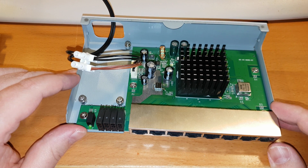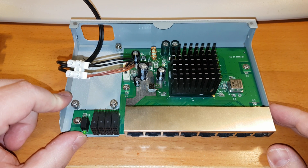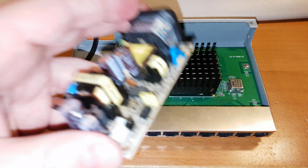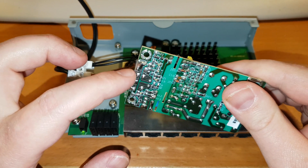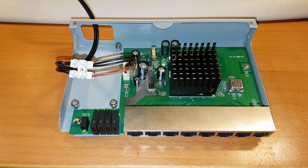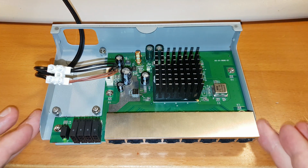I was thinking of buying a new switch, but I don't have to. So yeah, how lucky I am that, for once, I used my brain and got it working. It was just luck that I checked the voltage on the capacitors here, and I also checked that it was going to the power outlet here. So I knew, okay, I will test with 5 volts, see if it goes, and it did. So I got my nice 8-port switch back. Very nice, very nice. So see you later.